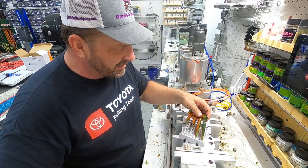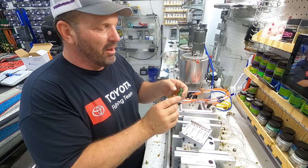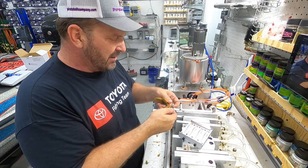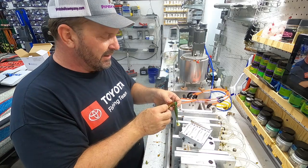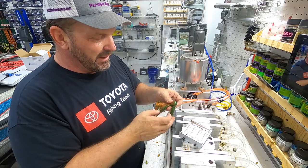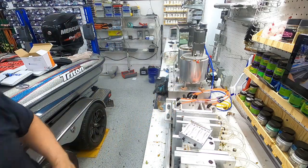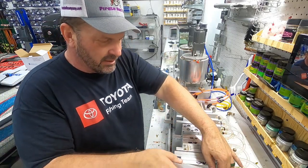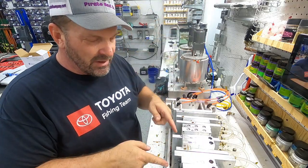Oh, this one I knew wasn't going to be right because I ran out. Remember I said you got to check your injector? That's why this didn't pour correctly as well. I ran out of plastic when I was running this mold, so we only got one. This is where it hurts when you do laminates and you're not paying attention. Instead of 4 good baits, I got one, and these nubs. They're all full of air holes and air pockets. So when you're injecting, always pay attention to how much you got in those tubes, because you don't want that to happen.